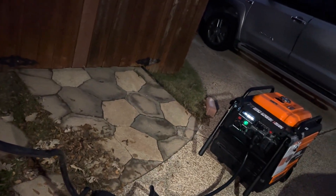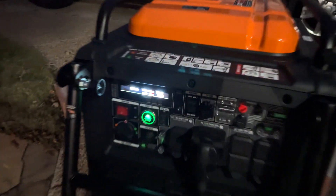It's saying overload and something else. You cannot charge your batteries from a generator. You can't? No, everything's saying no. It just sucks up too much power. So it looks like if your batteries are down, you will not be able to charge them from the generator. It's instantaneous — one powerwall instantaneously overloaded the generator. They're capable of sucking far more electricity from the grid and from the generator than it's capable of producing.